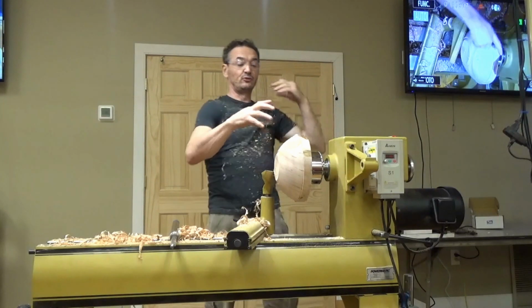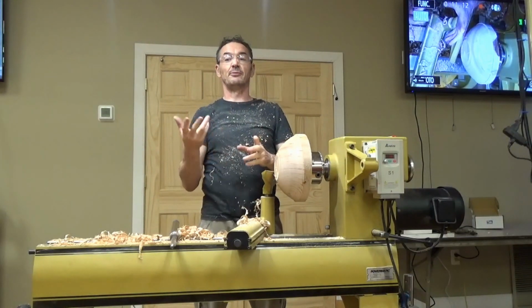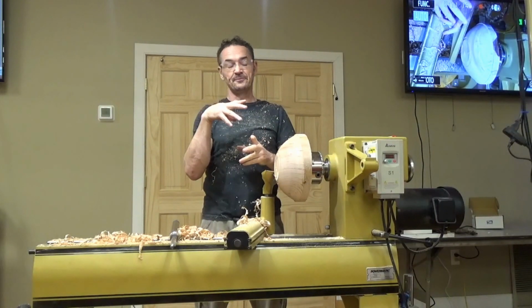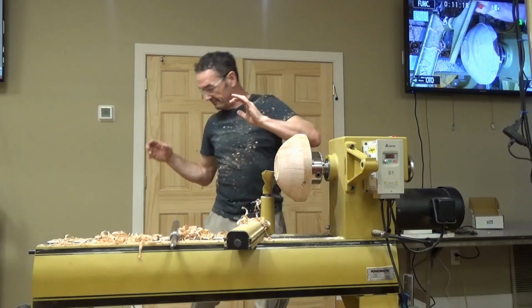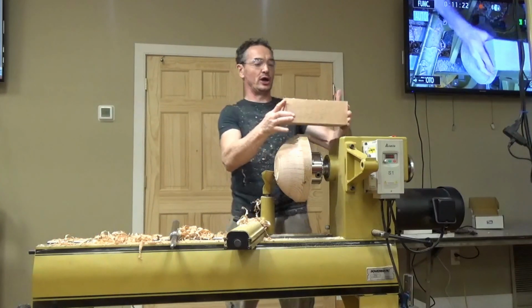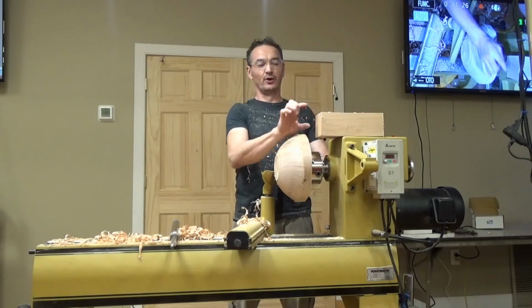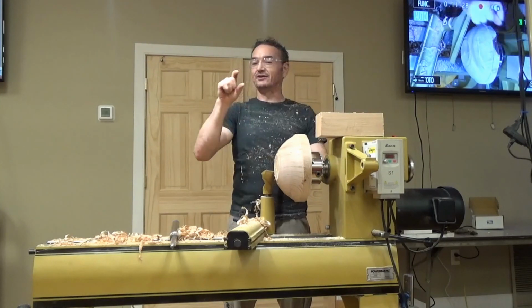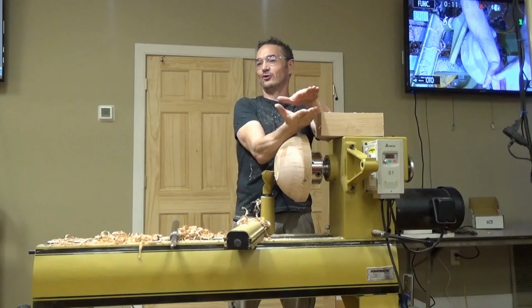Now, I used to work for a company when I was in my 20s called Hardwood Dimensions Limited. I used to help them import wood for wood turning, and they used to take 3-inch square blocks of hornbeam. In fact, it would be almost identical size to this. Maybe it's a little bit longer. They would take a 3-inch block like that, and in the morning it was 1.5 inches thick. Not 1.5 inches thick because they machined it down. They compressed it to half its size overnight.